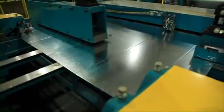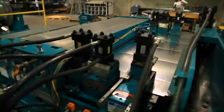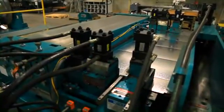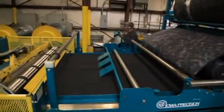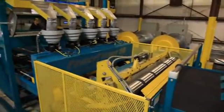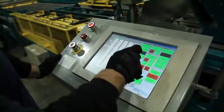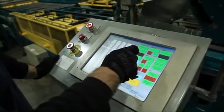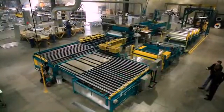An optional tie rod hole punching system is also available, and the notching system accommodates TDC or TDF flanging. For contractors with internal duct lining needs, the Insulmatic positions duct liner with glue and fastening operations, all automatically. The controls and processing features are designed, built, and serviced by Iowa Precision, providing total system support.